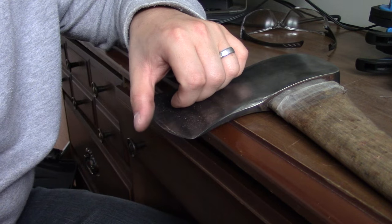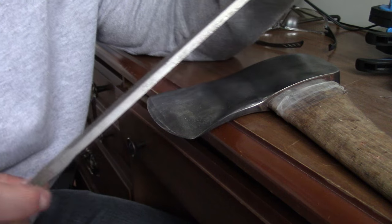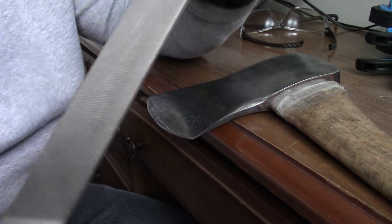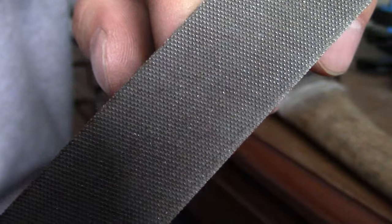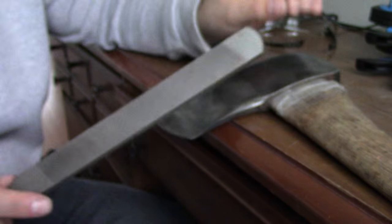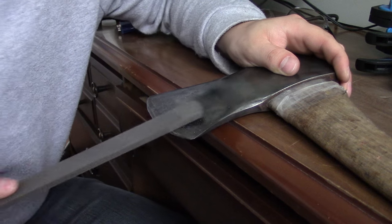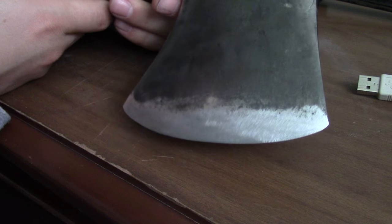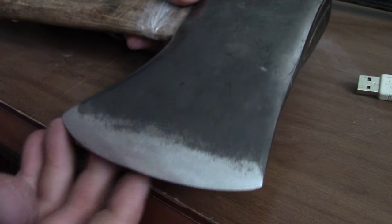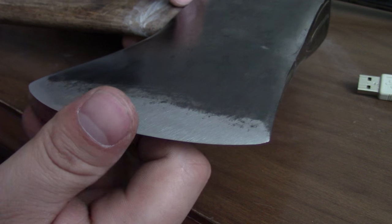That's awesome. Now I'm gonna put an edge on her. I didn't want to break out the sander this time, and this edge is actually not that bad. So I'm gonna use my standard mill bastard file here — it's a bi-directional one so it cuts quite fast. I usually find I can refine it a little bit with a unidirectional one after. I've been working on this for quite some time now — this is just a rasp edge. I've taken it from the raw edge I bought it with to this. I mean, you could use this axe like this.